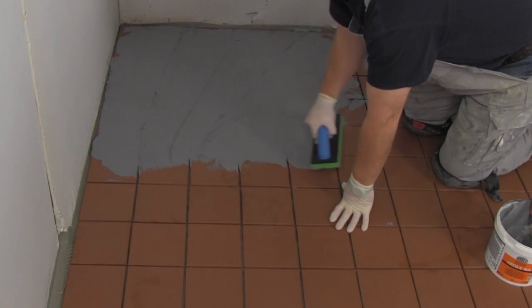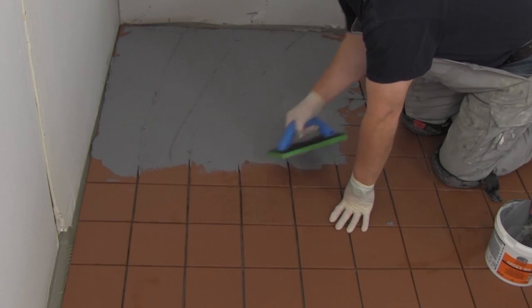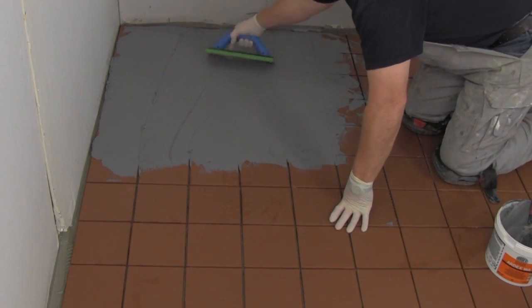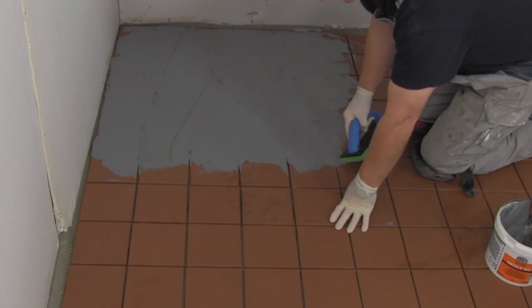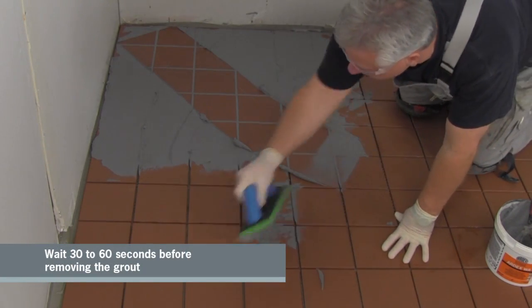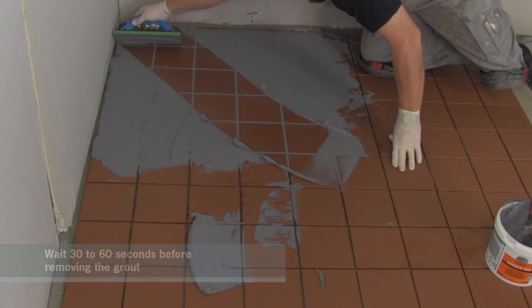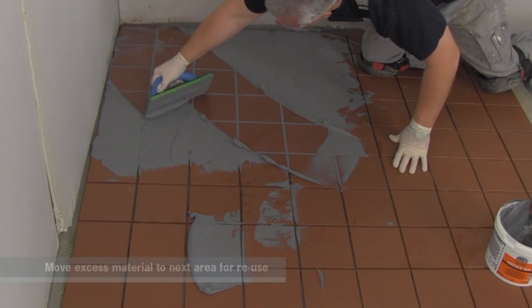Notice the heavy layer of epoxy that is placed all over the tiles. This is not typical in epoxy grout applications. However, with ARDEX WA, this technique assists with helping to remove the excess epoxy from the tile when snow plowing, without removing grout from the joints, and also gets more material out of the pail faster to achieve maximum pot life.